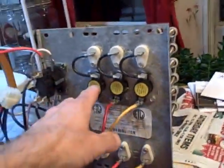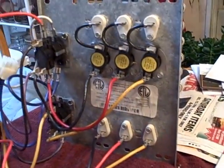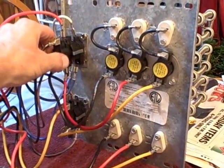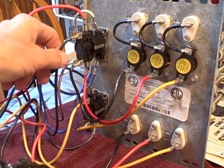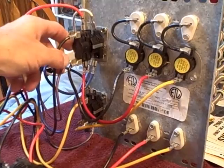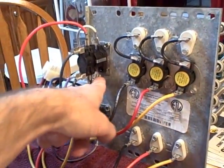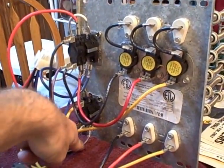So we have the safety devices here, and ceramic insulators to protect everything from the actual housing. And here we have the heat sequencers — a lot of people don't like these, I'm not overly fond of them, but they are what they are. Basically, you have the 24-volt coil here and here, and this one's looped over and tied to the 24-volt coil here and here.